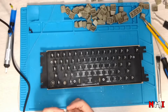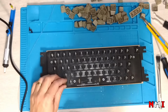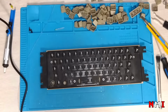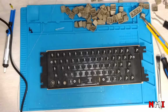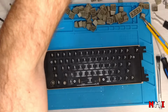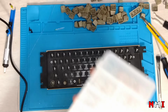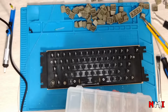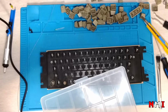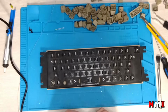Okay, so I've found a green LED. And it fits terminals good, so I'm gonna solder a series resistor, and it doesn't matter which side the resistor is, really it doesn't matter. So all I need is the series resistor. I'm gonna use a 330. Should suffice. Okay, so no, I'm not gonna use 330. Maybe the LED is gonna be too dim. So we're gonna use 220. 220 should give us a nice bright LED.